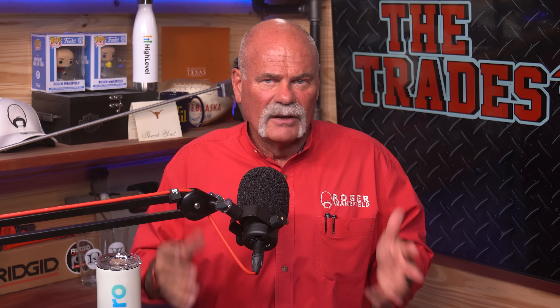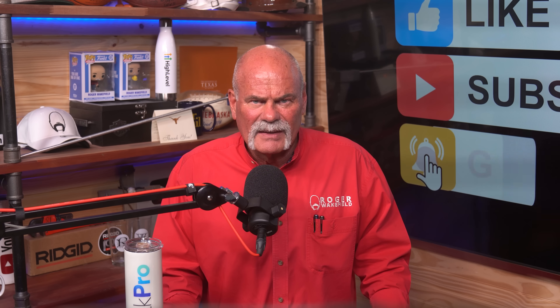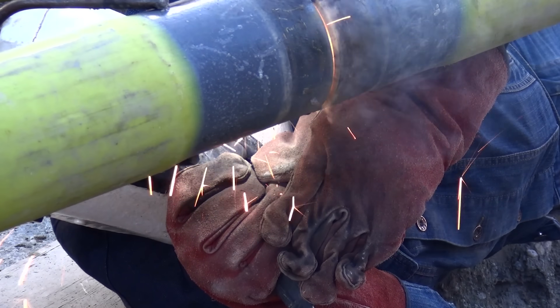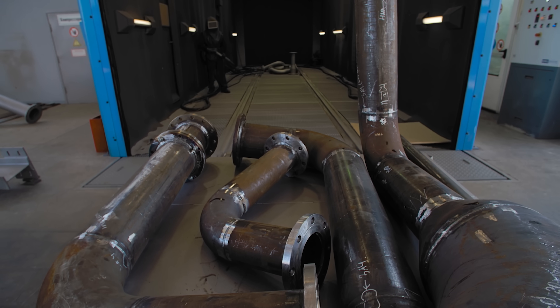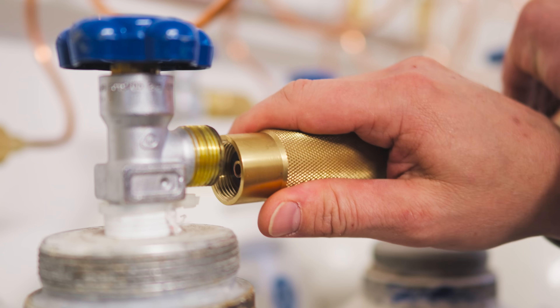Imagine pouring soapy water around a riser and it looks like it's boiling — that's kind of what it was. Remember, ignoring the testing step can be deadly. I know we get in a hurry and think it's no big deal, but that one time you do have a leak and you don't test it, you're going to be in trouble. Safety always comes first, so remember these key tips: always use approved materials and fittings that meet local codes and standards, and before turning on the gas, make sure all connections are tight and secure.